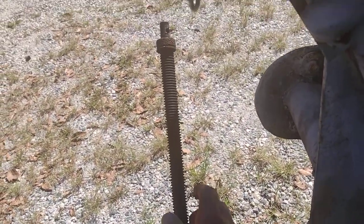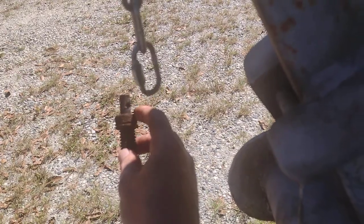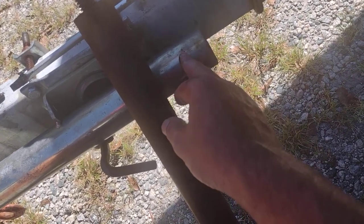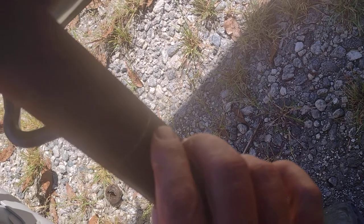I've got the inner part of it out. Up here is where that gear I just pried out with the screwdriver goes, and it's just one big screw attached here by a crimp. Where this lined up — the end of the outer pipe lined up with here — since it was extended all the way out, I made a little scratch in it, and I'll show you what that's for in a minute.